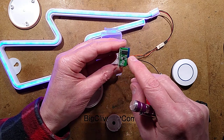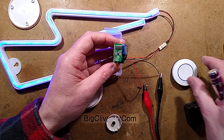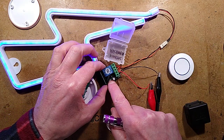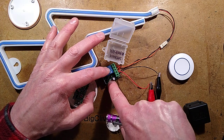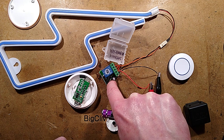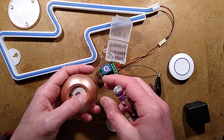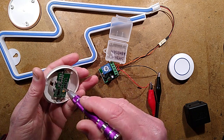The receiver has a microcontroller on it and also a little receiver chip, and it is decoding the pulse. If you try programming another remote to this receiver, it doesn't work. To toggle it independently, you can just push the button to toggle it on and off. To clear it completely, press and hold it down until it goes on, then off, then on again - then let it go and it clears the codes, ready for programming a new button.